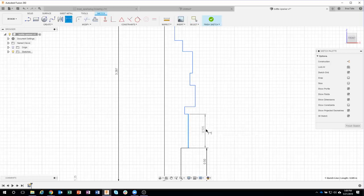And I'm just going to go ahead and click on some of these heights. So, for example, this is supposed to be 0.635. Now, watch what happens when I do this. And this is exactly why I said kind of start to create your basic shape and kind of get some dimensions on there. You'll notice that when this went above it, it kind of makes this a little bit confusing. Okay. Well, all I have to do is just grab that line and bring it up a little bit. So if your sketch kind of overlaps or whatever, you can drag that up.